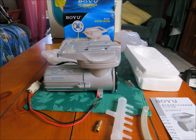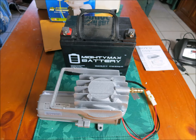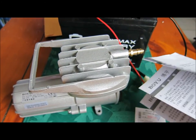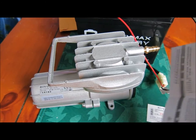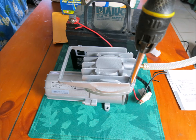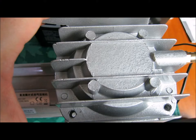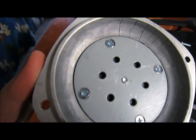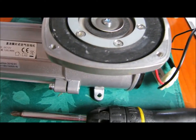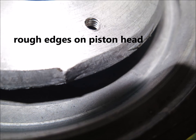Let's go over the pump and how I opened it up and cleaned it. When it came it's rather small and lightweight, which is good — it's your standard small oilless compressor. I turned it on to make sure it worked. Then I took the cylinder head off, which was very easy to do. When I did, I saw a lot of dust and accumulated debris on top of the membrane. The workmanship also needed to be filed down and sanded because it was rough, and I think it could eat up the rubber diaphragm. Part of it is aluminum so it wasn't hard to work on at all. I used sandpaper on the outside and a file to get down some rough marks on the edges.